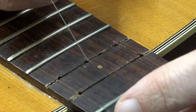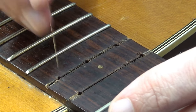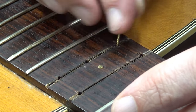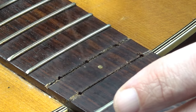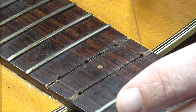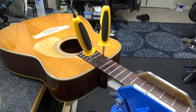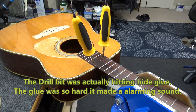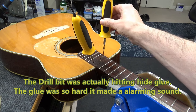I think I found a nice big pocket back down over here. I think I'm drilling into solid wood there — this one hits the pocket. There's definitely a pocket back here, which is nice, but over here I'm just drilling into wood. I was getting ready to drill a big hole for my StewMac heat stick, but I kept hitting metal — the end of the truss rod protruding into the pocket. I don't want to break my drill bit, so I'm going to go with these little skinny guys for starters. They seem to go past that metal object.